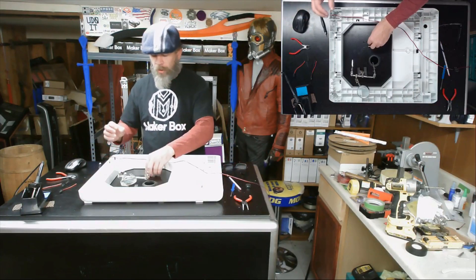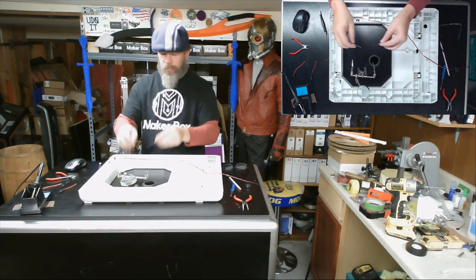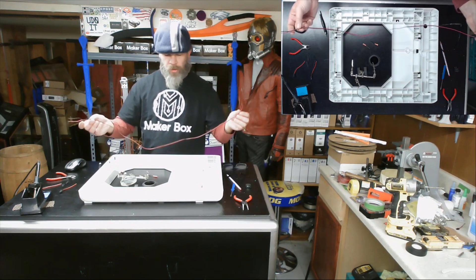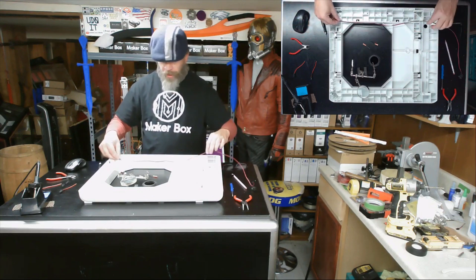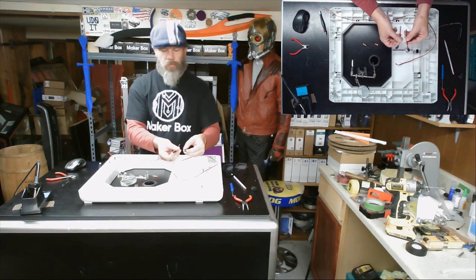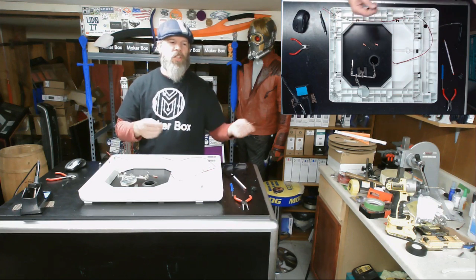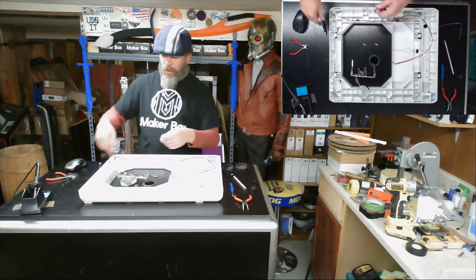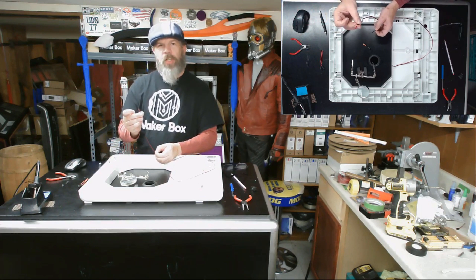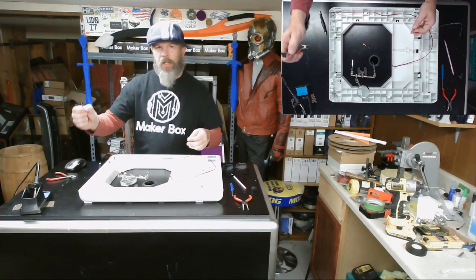For the next part of this upgrade, we're going to need the connectors that used to plug into our switch. I went ahead and cut them off, leaving about an inch of wire on the end of each one. You're going to need a scrap of the red and black wire that came with your E3D hot ends. We're going to feed it from the front to the back, then solder one half of a JST connector onto it and put the other half onto the power supply — that way if you ever need to take the bottom tray back off it's a quick disconnect. So right now we're going to strip the ends and tin them, solder this on, insert our switch, feed it down the trail to the back, figure out our length, and add on one half of our connector.